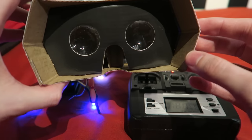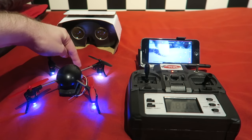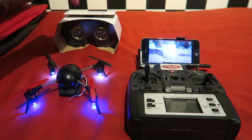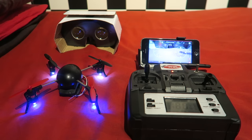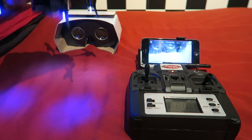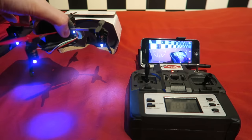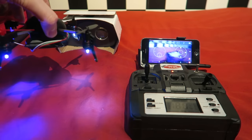The wide field of view of the goggles capture the main picture perfectly. This is going to deviate depending on your phone's screen size. The view through these cardboard goggles however is much bigger than my aftermarket VR goggles. They have been specifically designed for the Micro Drone and they have done a really good job. You can also wear glasses with these goggles quite comfortably. It is possible to FPV with these goggles but there is a small amount of latency between the image and the camera. This is expected from digital FPV and I suggest having a big wide open space to try it — just make sure that you have a spotter in case you go out of range. Without the range extender you will get a 25 to 50 meter range from the video.